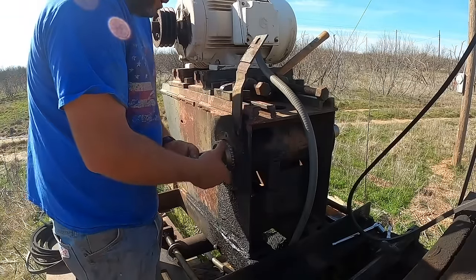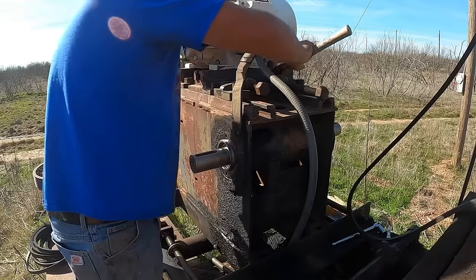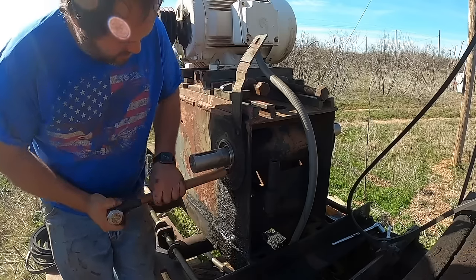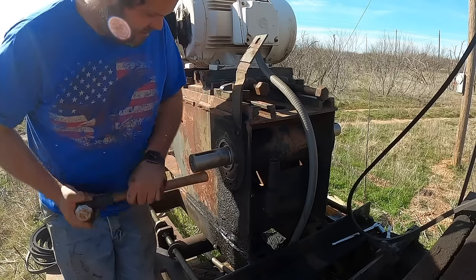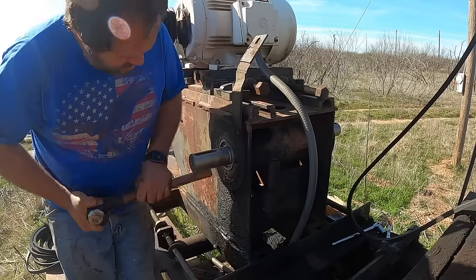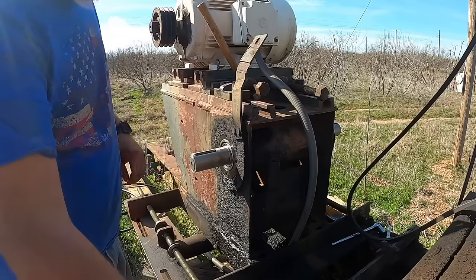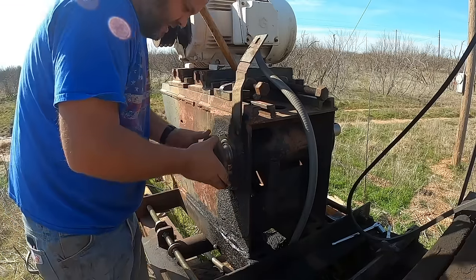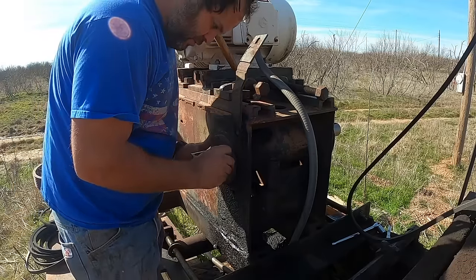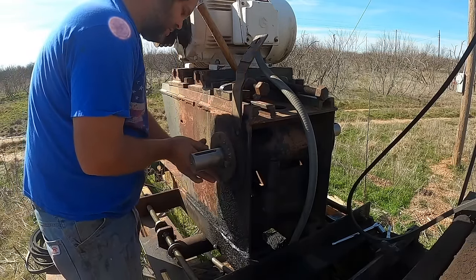All right, I'm going to drive this other race in. And I want to take this seal housing and start it and snug it up, you know, loosely, without any shims in it. And we ought to be able to visually see or measure.